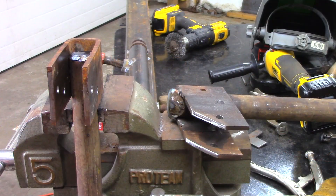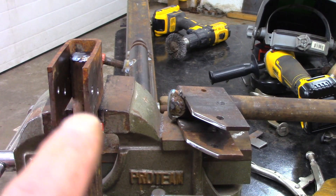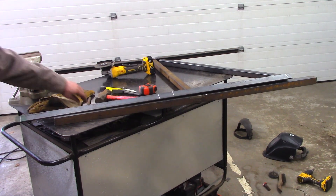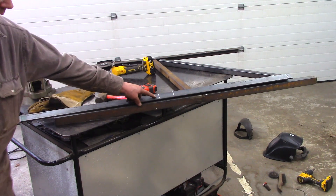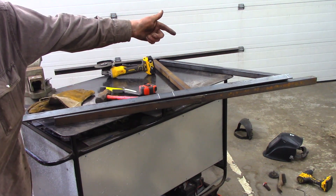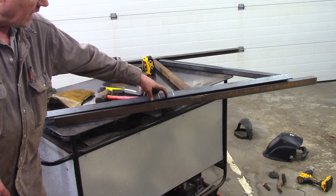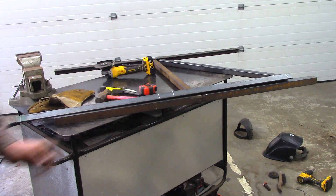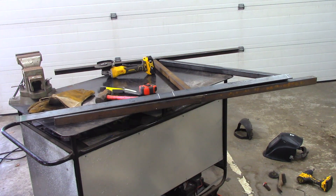As promised I got the pipe positioned further down to get more angle. Now I'm measuring up for the holes to mount the panels: on the panel it's 7/8 inch and then 26 and 3/8 inch. I measured from both sides — 7/8 and 26-3/8 from each side. Your panels could be different, but measure from both sides rather than all from one side. Use a center punch before drilling so you're dead on.